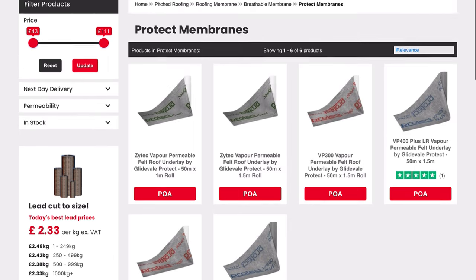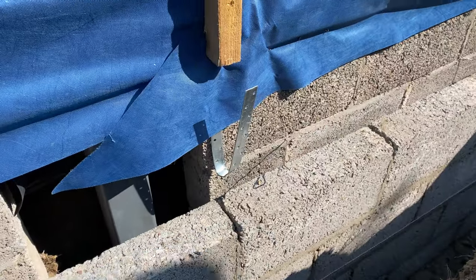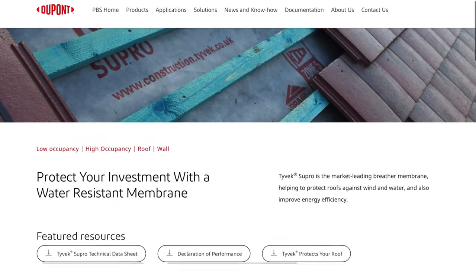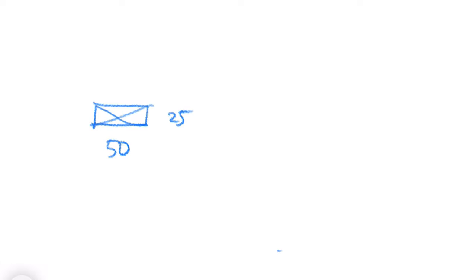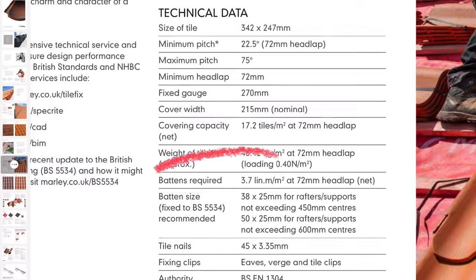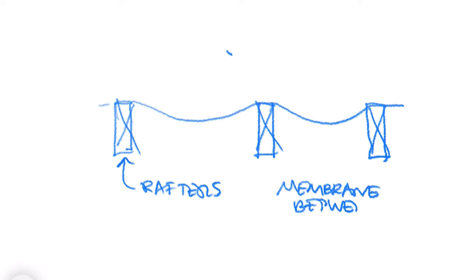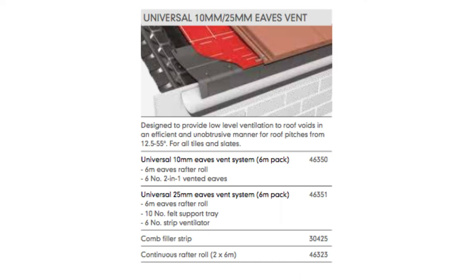So back to our underlay — let's choose a breathable membrane. Be sure to check that it is a roofing membrane. Standard membranes, such as this blue one we're using for the walls, won't cut it; it's too light a gauge and without boring you with the rules and regulations, it won't comply with the British Standard. We need to set out our battens — in this case we don't need counter battens since we're not using a deck. Roofing battens will be 25 millimetres in height and either 38 or 50 millimetres in depth, depending on your rafter centres and the weight of the tiles. The membrane will sag between the rafters and any moisture will be able to travel down to the bottom into your gutter. Set out the membrane from the bottom with overlaps to suit the manufacturer's instructions. The most important thing is to set out the roofing battens starting from the bottom — since you don't want a cut tile at your eaves, you set out these battens based on the tile length and allow a suitable projection to the roof edge, normally 50 millimetres.